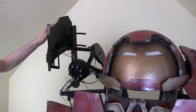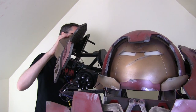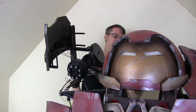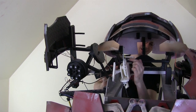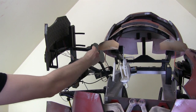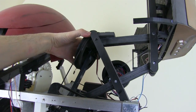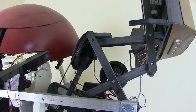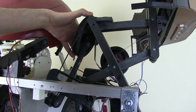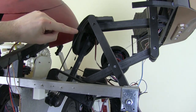I've got one small issue mechanically, which is the servo that lifts these isn't really strong enough. It doesn't work very reliably and the servos get stuck and sit there chattering. So I'm going to design a mechanism that's a bit better than that with some gears. The way this currently works is I've got a radio control servo — a fairly hefty one — that turns a huge pulley and there's a smaller pulley at the bottom which a cord also runs around. The cord's anchored on a white block so as this turns it winds the whole mechanism up and down. But the servo's not really up to it so I'm going to use another motor and turn a gear to turn this pulley.